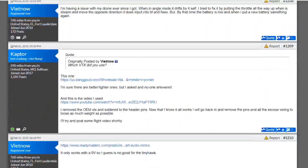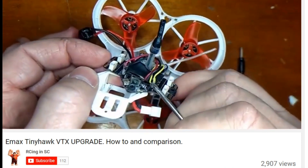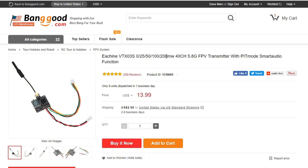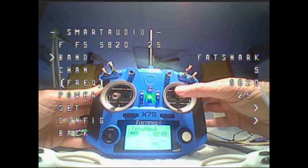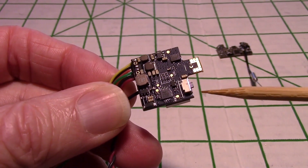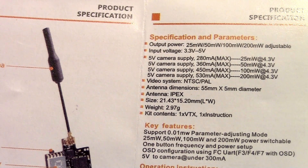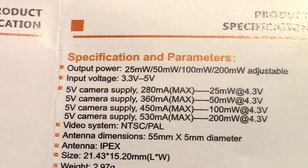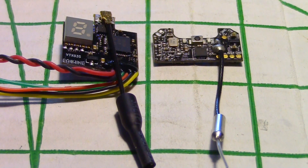There was a link from RC groups to a video by Racing in SC which showed how to replace the VTX with one from Eosheen called the VTX03. I decided to do the same but as one of the commenters suggested, it's better to use the VTX03S which has smart audio. Just as the stock VTX, the VTX03S allows you to use the radio sticks to control the menus of the VTX to change the frequency and the band. This is handy because the button on the new VTX is not accessible once it's installed inside the Tiny Hawk. The VTX03S also has 4 power levels that can be controlled through the smart audio stick menus. The stock VTX only has 25 milliwatts selectable, whereas the new VTX is switchable between 25, 50, 100 and 200 milliwatts. Here is the size comparison between the stock VTX and the Eosheen VTX03S — remember the S stands for smart audio.